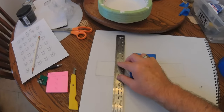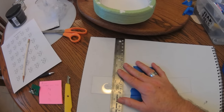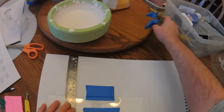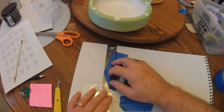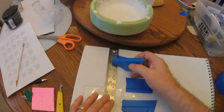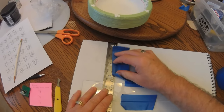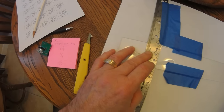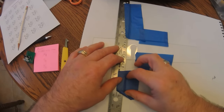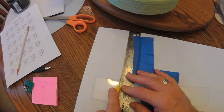Because the metal ruler is also slippery on the plastic, I like to use the same trick here as far as taping it in place, just using the masking tape. That helps during the scoring process to keep everything lined up. I hate it when the darn things slip and you end up with an inaccurate line. So just using the tape like this ensures that it does stay in place while you're doing the scoring. I'm just using a scoring device I got from